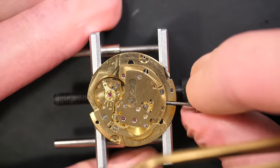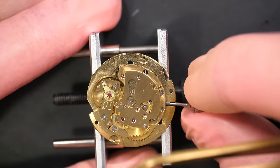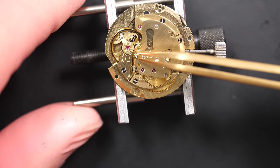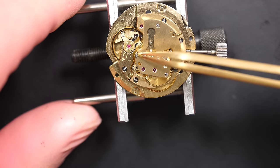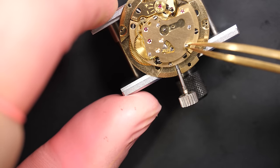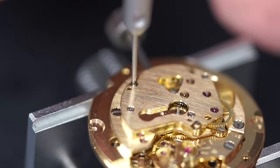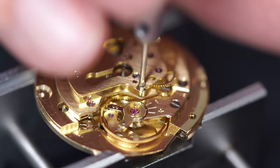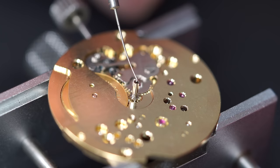When it's done, we can place it back on the main assembly. Placing it in position — you can see when it's turning, everything is connected, all the wheels are turning perfectly. Now putting the two long screws, which are very dangerous being just above the balance wheel — that was a tense moment. But being long screws they're easier to handle. That's it done.